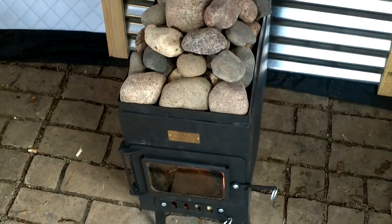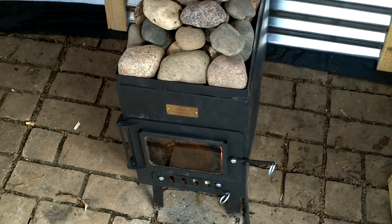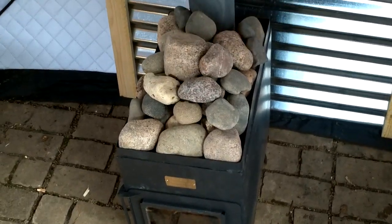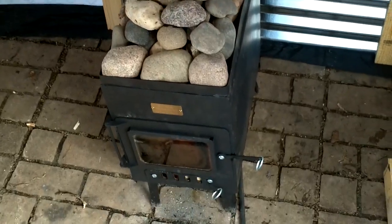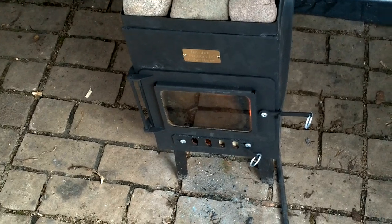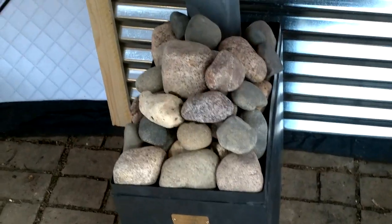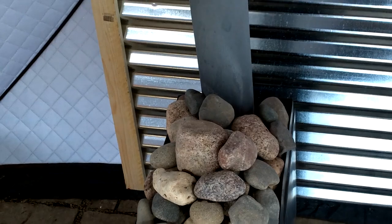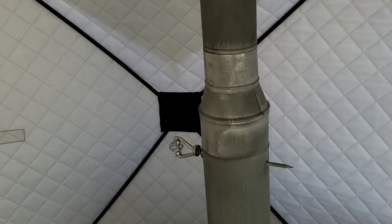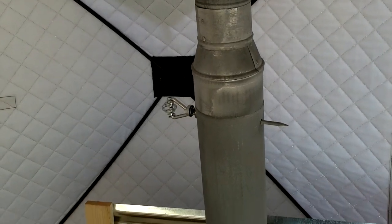Here's a close-up of my preferred sauna tent stove. If you're going to basically leave it in one location, this is a heavier steel stove. It does have a glass door, it has a draft control at the bottom, and it is set up for four-inch pipe. But our sauna tents are ideal for three-inch pipe, so right here is a four-by-three reducer, and there's also a damper there.